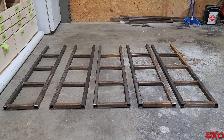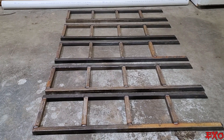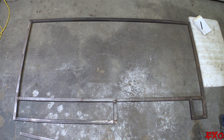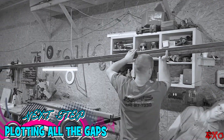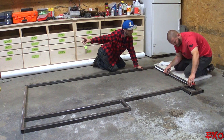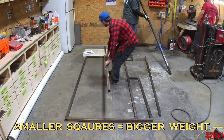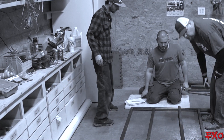There's the fifth one, all done. Got a better idea of what it's going to look like from front to back — that is a lot of bracing, a lot of steel, very strong. The sides were a bit different to decide because there's no additional beams from the roof anymore. Did some number crunching with these side pieces. We're going to be doing some more steel down the long way — about 93 inches — and it's going to eat up steel really quickly. We're debating on whether to do two on the inside or three. Basically, it was a game of give and take finding a happy medium of gap size.